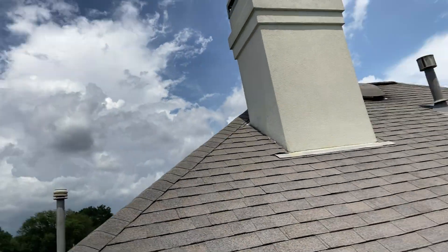When you're getting a roof estimate, or if you notice on your existing roof that you have two types of exhaust ventilation, just check that out. It's not always a bad thing — if they're spaced out, for instance if we had an attic fan on this ridge and ridge vent on that other ridge, that would be okay; they're not going to short-circuit each other. But when you have two types of exhaust ventilation focused on the same ridge, you're going to have problems. It's an insidious problem — not something you're going to notice right away, it just creeps up over time.